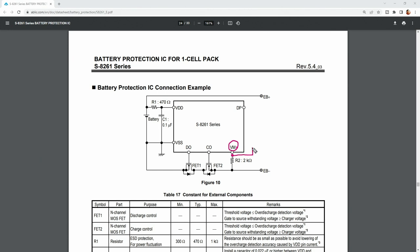This VM pin is exactly what we can find as the third pin on the battery package. In this case, it is connected via a 100k resistor. Under this video, I attached the datasheets of the chip and MOSFETs, so if you like, you can have a closer look at how exactly it works.